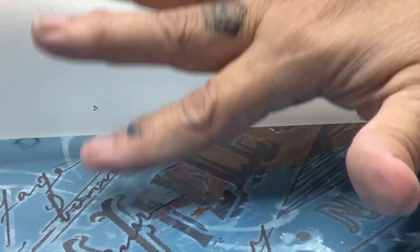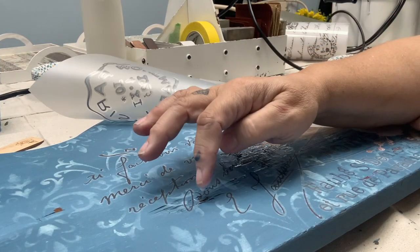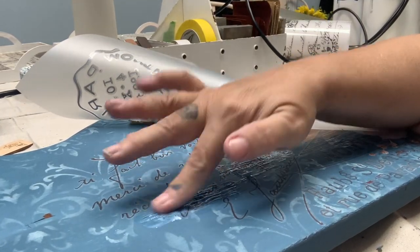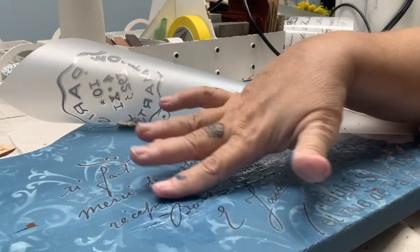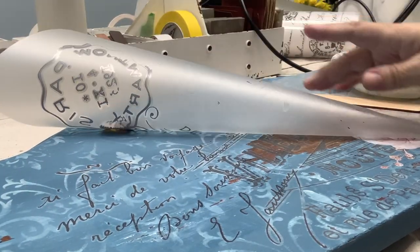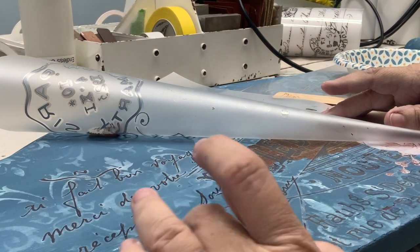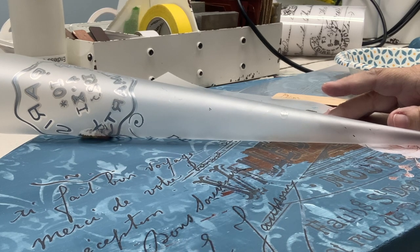Just with my finger, not a brush, because a brush might wipe it away — I have a lot more control with my fingertips. In places where it's lifting, the liquid of the top coat is actually kind of making it bubble a little bit more, creating more of a pull so it's lifting it. I don't care about this being chippy — I love chippy. If you add enough top coat, and I'm using the Dixie Belle flat top coat, even when it's bubbly you'll sort of make it stick there so that what's lifted will be hard and won't be able to pull up.